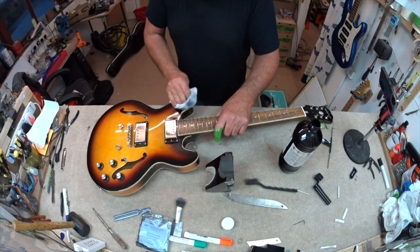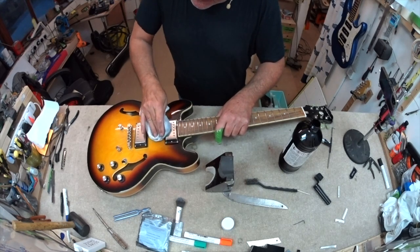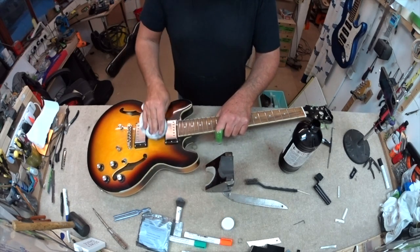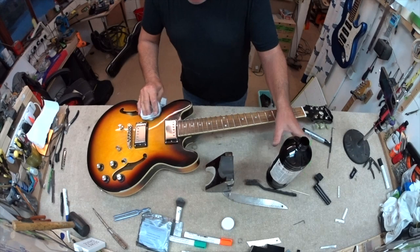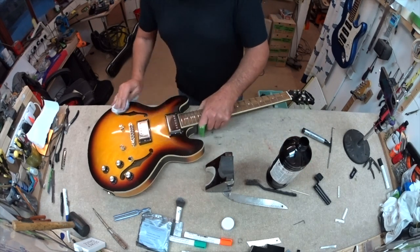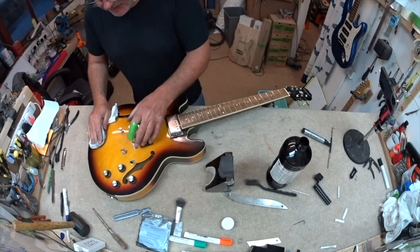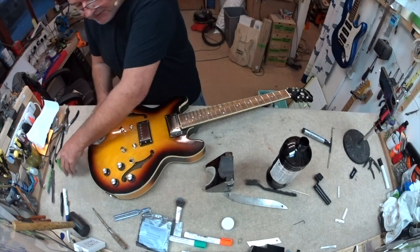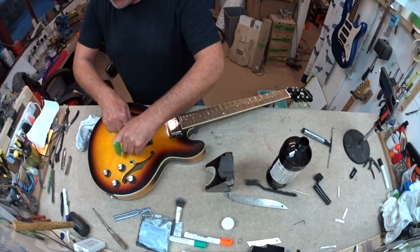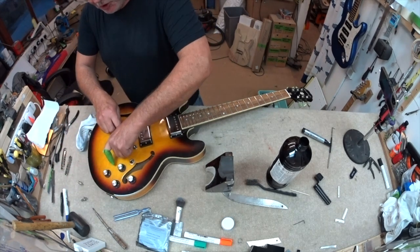And if you did rehydrate it too much, it would probably warp, because water and wood aren't the best friends, as you know. Any time you've ever had a warped guitar neck, it's because of water and warmth, usually, or humidity and warmth. So you're not really humidifying anything. What you're doing is cosmetically adding oil, and the more it soaks in, the darker the wood looks.